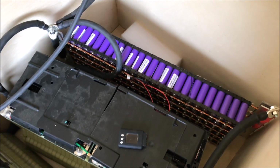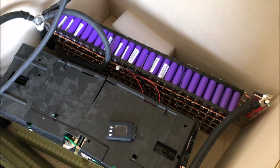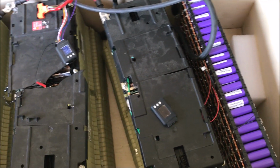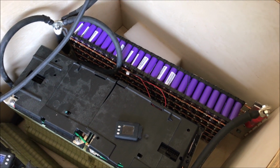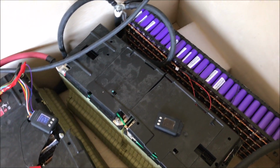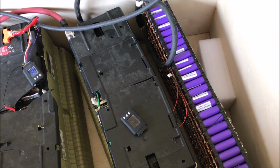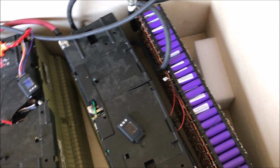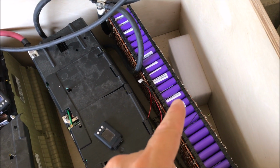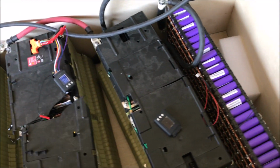And the last thing is about the 1S battery that I created, the 300 batteries in parallel. It is a higher voltage than the other, typically 0.2 volt. I think that it has more capacity compared to each one of the cells in the other batteries. So that's not a bad thing. It just means that when I'm losing power on the batteries, this battery will stay with higher voltage, meaning that if I had a little bit more power on the other batteries, I could have run a little bit longer,